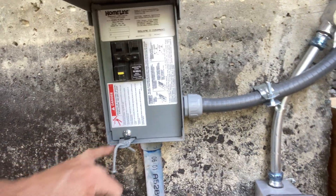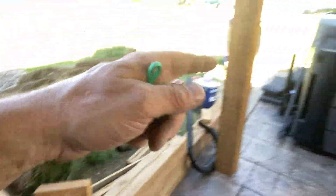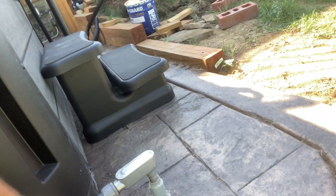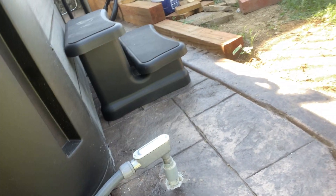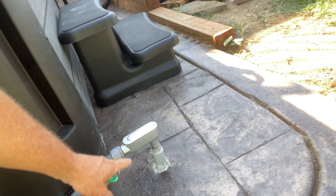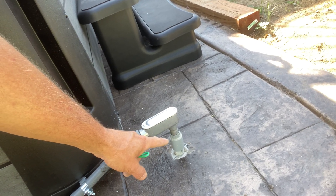It was a Hot Springs tub with Schedule 80 PVC, all run under the cement. Code requires four inches deep under the cement, which is what the cement guy asked for anyway. Then that popped up right over here. They said the tub was going to go a little further to cover it, but they changed their mind — as usual. Those are not easy to move; you can't do those underneath the tub, it's impossible.